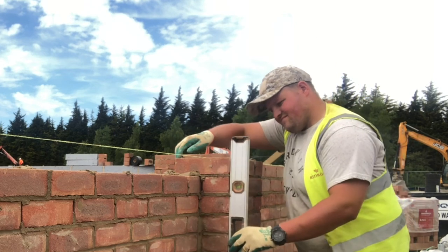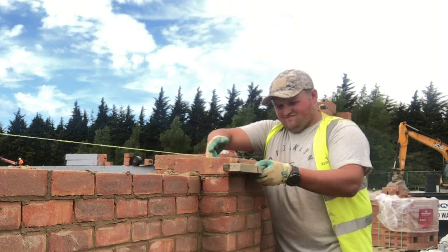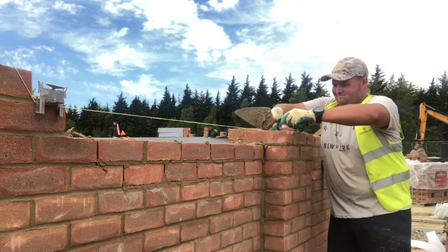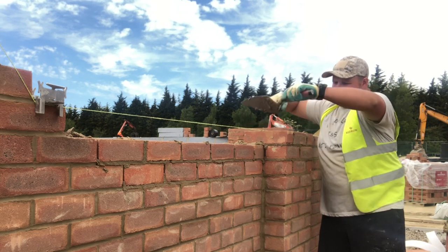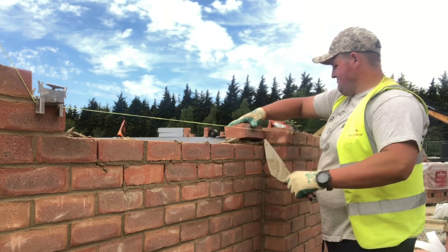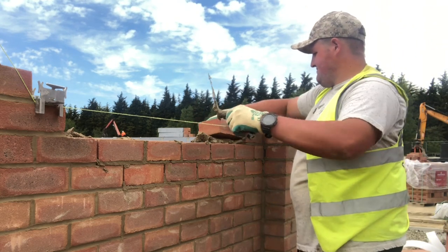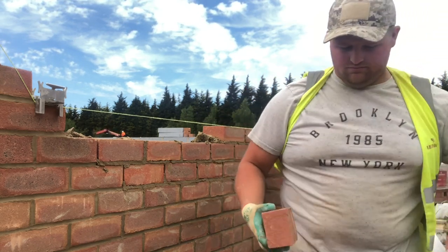If I know I've got 300 bricks left to lay above the waist, I'll get all 300 there so we don't have to reset. We'll stack them up in sixes on top of each other, twisting every three stacks so they don't fall. When we get to milk crate height I'll stack all bricks either right up on the boards — which is ideal — or on the floor elevated off a block, just two at a time, working up from there.